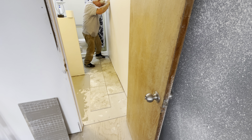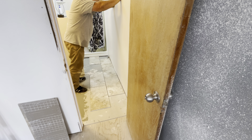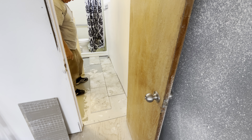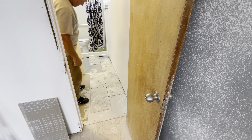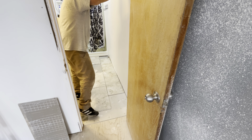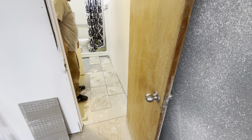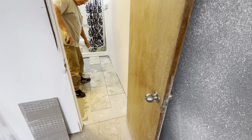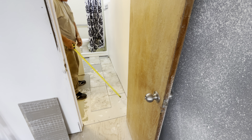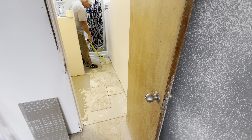If I shift this up a little bit here, that's going to shift this up, and I really don't want to go any further because I'm going to lose it here. About somewhere like this is where you want to be at. Here's still a fairly big piece — this is relatively big, it's not a sliver. And this is relatively big, and these are both about the same size. That's eight and three-eighths. This is unedited — I'm within a sixteenth of an inch.